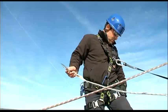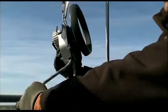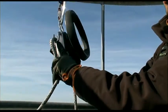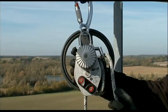you connect the end of the rope to the victim's harness, or to his fall arrest connection if you're unable to reach him. Then you put the slack end of the rope into the pigtail and into the cam cleat situated at the back of the device.